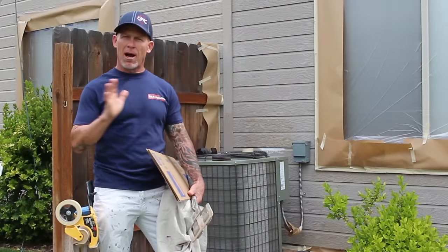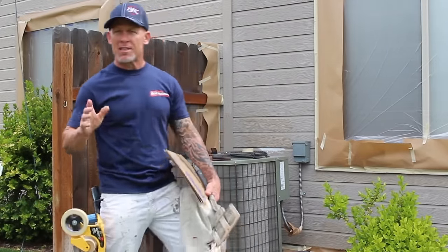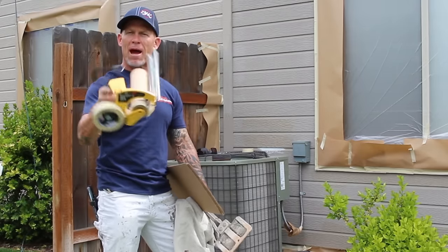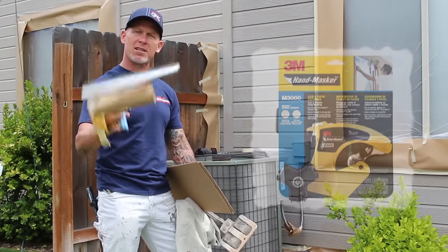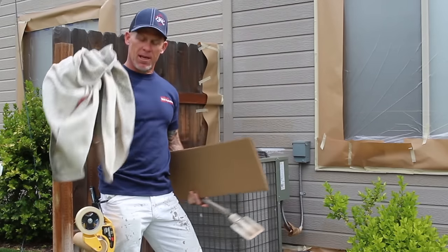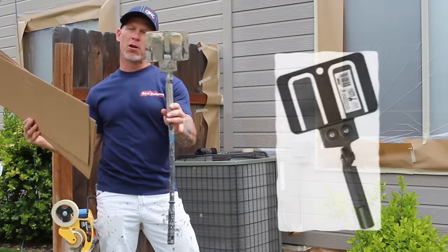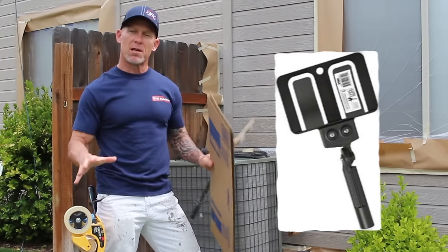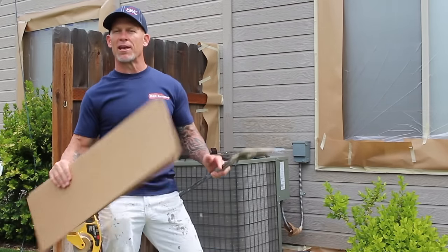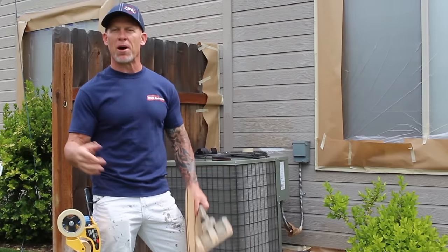In this video, we're going to be using some tools and products to actually help control overspray. Some of the things you're going to need when painting with an airless sprayer is a handmasker — we use a 3M M3000 handmasker — with 9-inch paper and 1-inch 2020 tape. You're always going to need drop cloths to help control any fallout or overspray. We also use our craft cardboard shield holders and cardboard shields to keep paint off cars, fences, concrete, or anything you don't want paint on.